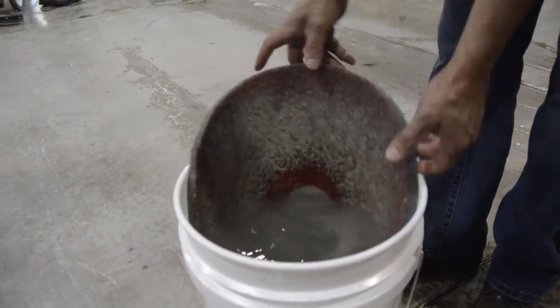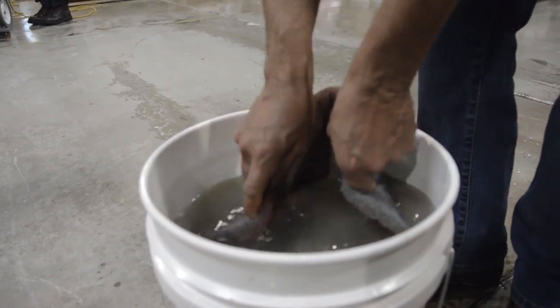If you do not do this, you are going to have to use a new pad, because this pad will be impregnated with dirt and the dirt will not let the diamonds do the work. Most importantly, rinse the pad with water immediately — especially the red diamond pad.